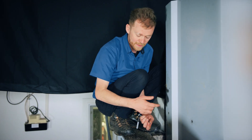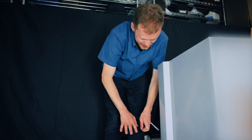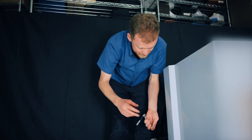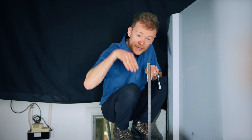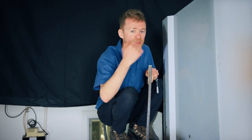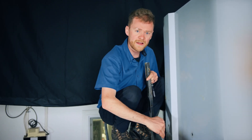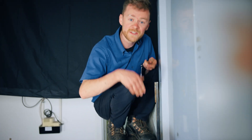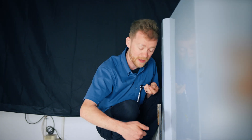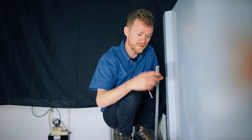I've got the one on the other side and the one on this side. If I was on a machine with sheet metal I could still reach this — I'd either be standing on the sheet metal or it would be open. Both brackets are off. You've got to look at the bracket and remember that it sits this way and goes in the front channel, because if you take them off and then put the head cover on you'll be confused about how it goes. This has the older style Z weight cover, so it sits in the front and goes down to cover against coolant and chips. When you put it back on, it's way easier to slide the head cover in, then put the channel bracket, then bolt it down.